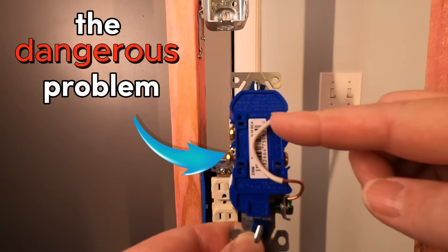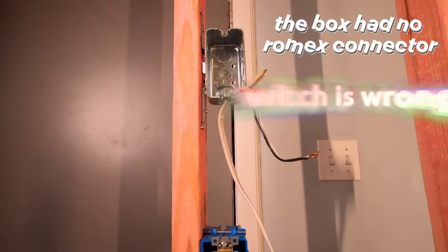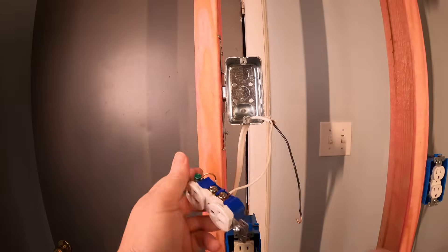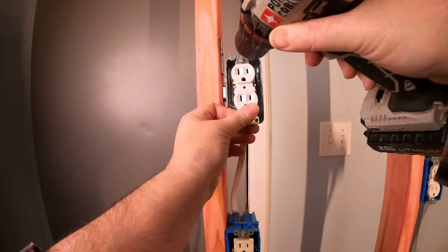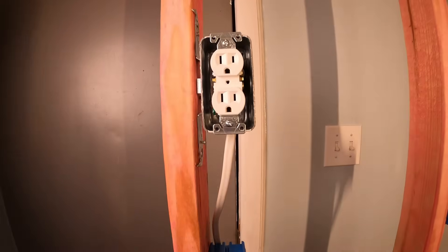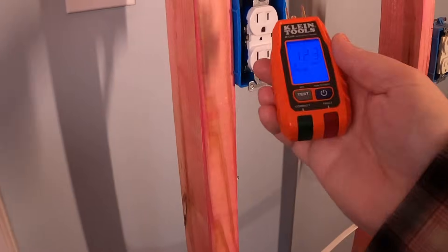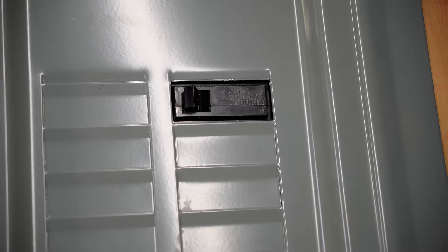This is the trick that's going to fool the cube tester. Here I'm adding the wire that I'm going to pull power off of — this receptacle right underneath this metal box — and I'm installing this outlet correctly. Neutral goes to the neutral side and the black hot goes to the brass side. Then I'm going to fold the wires up and install the receptacle. Now that I have the modified mistake receptacle, I'm going to add the metal weatherproof cover without the gasket — that's how I found it. It wouldn't make a difference anyway because the metal screw bonds the cover to the box.